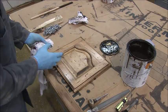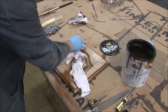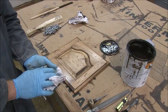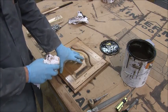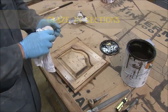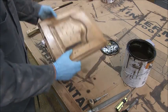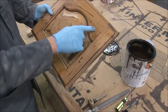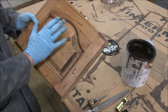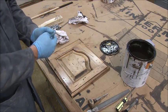You'll repeat this process through your whole project. Remember, your last wipe needs to be with the grain. My last step is to look around for fingerprints, get everything going in the same direction, and wipe it all off really well. Then move on to the next section — do this in sections. Glaze dries much, much faster than stain, so do a side, wipe it; do the door, wipe it; do the drawer front, wipe it. Be careful not to let it over-dry — it's very difficult to get back off once it dries. When you're done, you've got a nice door that's nicely glazed, or if you've distressed it, it's beautifully distressed and looks nice and old. People pay a lot of money for extra distress, so make sure to wear your gloves and it'll look fantastic when you're done.